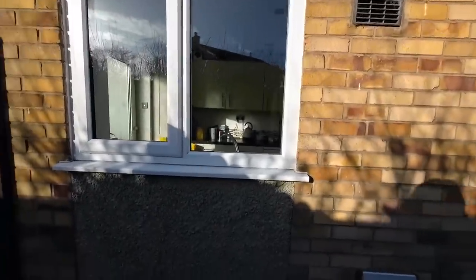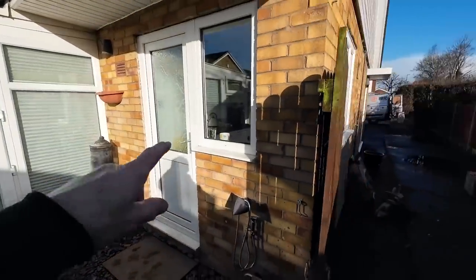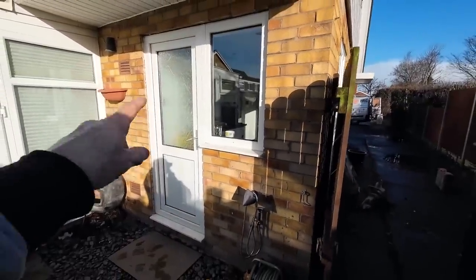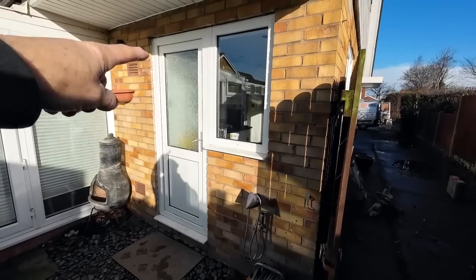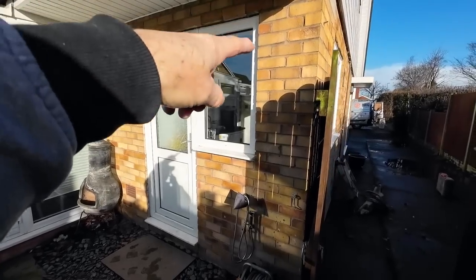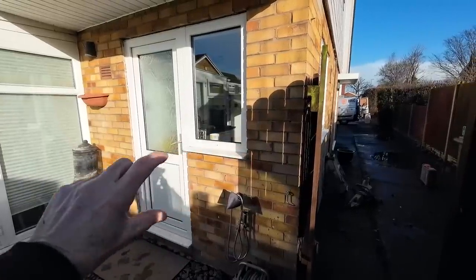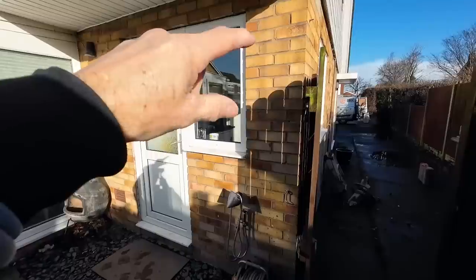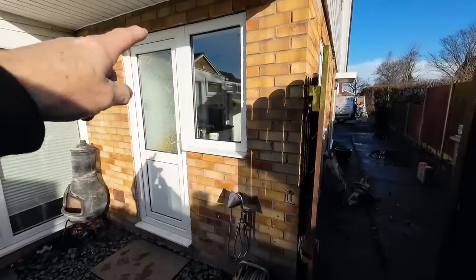And then this window, it's being transferred to here. So it's going to be put against this edge. Then this side's going to be toothed out, and all that's going to be toothed out. So that's going to be bricked up to the window, and then we're going to brick up this side up to the window, which comes to about here. So the window goes in here,